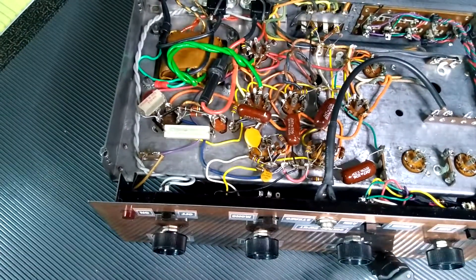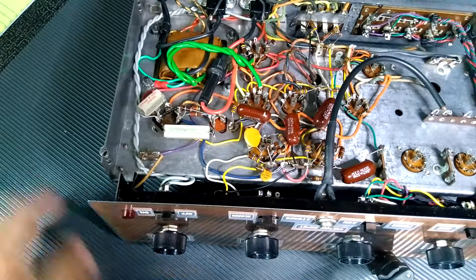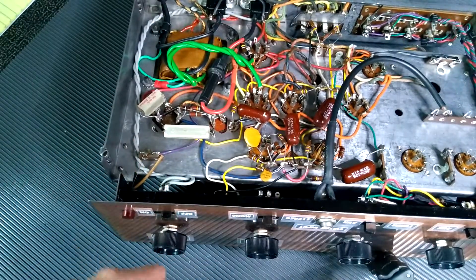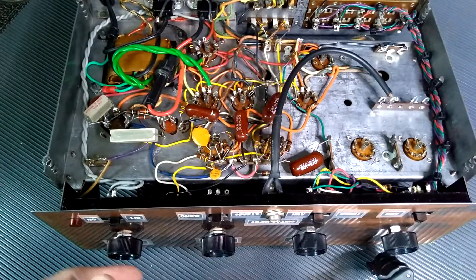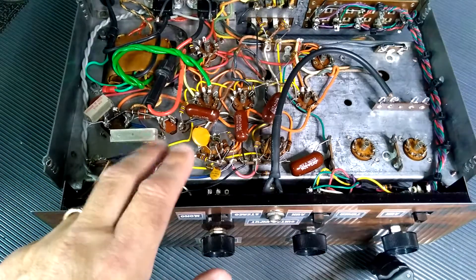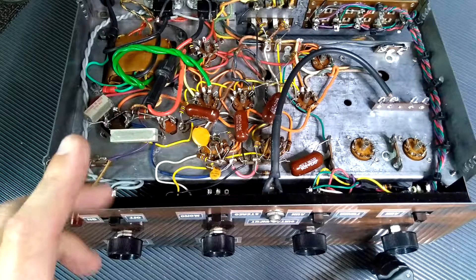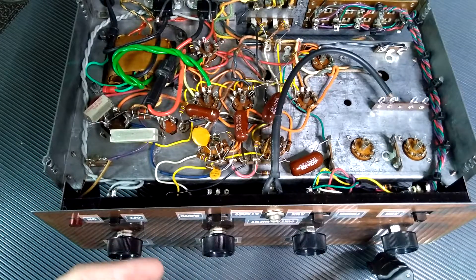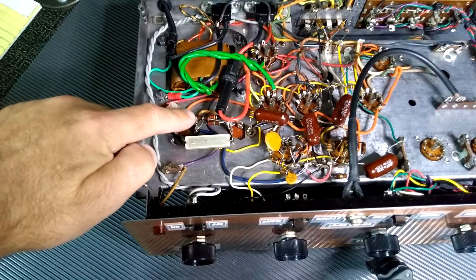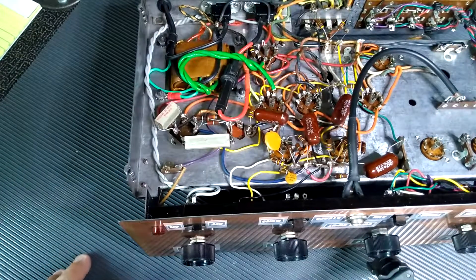Over on this side, this amp originally had a two-wire cord with no panel-mount fuse or anything, so I went ahead and replaced it with a three-wire cord and put an inline fuse holder in there with a 1.5 amp fuse for protection. One of the cool things about this amp is it uses these brown drop capacitors — there weren't a bunch of electrolytics that needed changing. However, I am going to change the two can capacitors because those are probably out of tolerance. I checked all the resistors and capacitors and everything is within tolerance, except this one resistor here was fried and overheated — I couldn't read the color bands so I did replace that resistor.